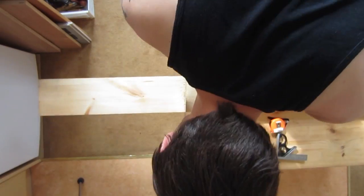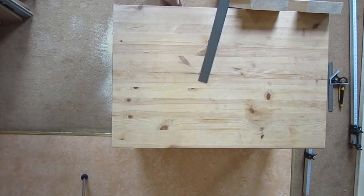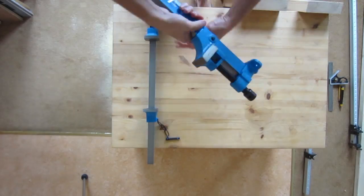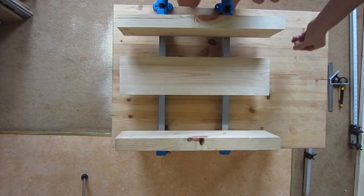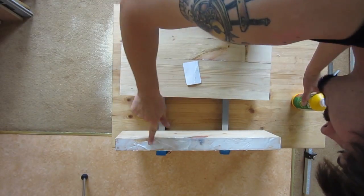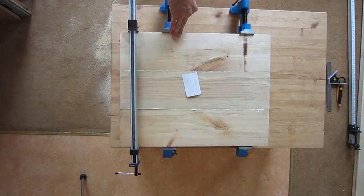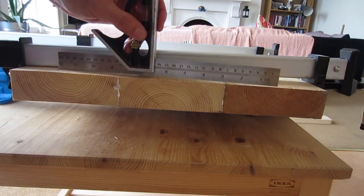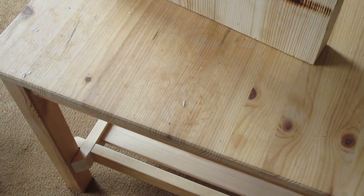There is me using my Japanese saw. Now, it goes to show exactly how long this project took me, because in there I'm in shorts and flip-flops, and by the end you'll see there's a Christmas tree out. These are the sash clamps that I am going to use in vise version 1.0. Here I'm just going to use them for clamping the pieces of the top together and gluing them. I am actually working on my coffee table, because obviously at this point I don't have a workbench to use. I am trying to get a pretty even spread on the glue. After it was all glued and clamped together, using another set of sash clamps, I actually realised it's got a little bit of a twist in the wood. I should have checked this beforehand — I could have planed out the edges to make them flat, so I'm just going to plane this back at a later stage.